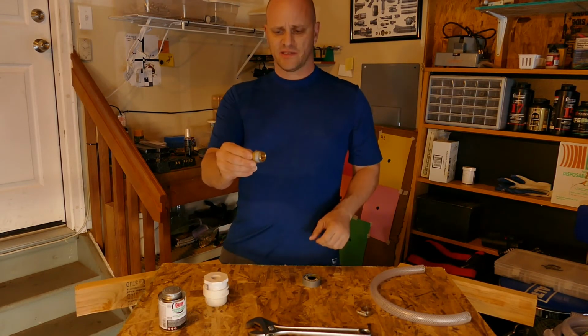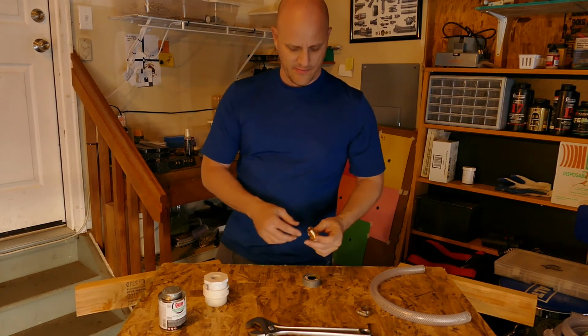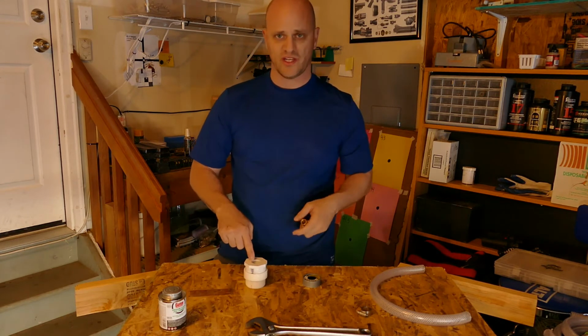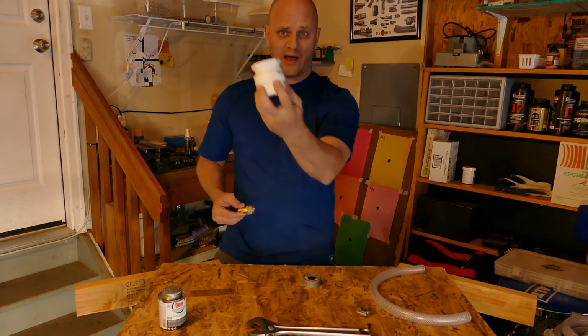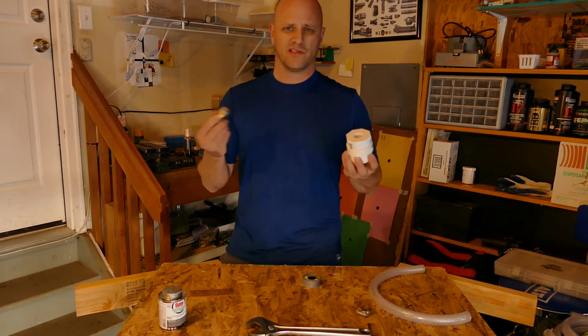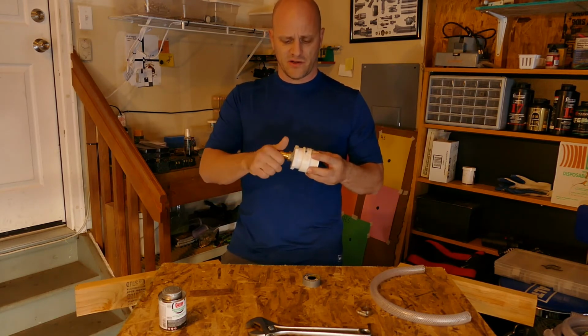The next piece is the brass fitting. All right. This was going into the threaded end of the 2" by 3/4" PVC flange here. And without touching that glue, I would recommend waiting until that dries to do this, so about 24 hours. So this isn't a full day project, but you know, a few minutes as you can see. Start threading that in.